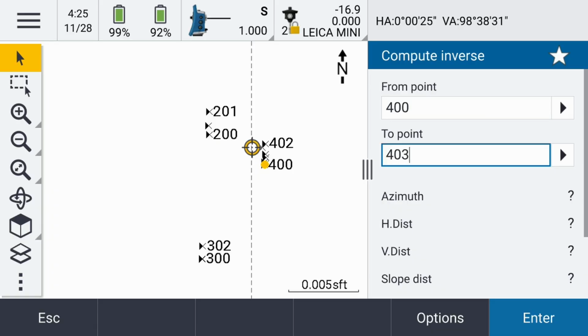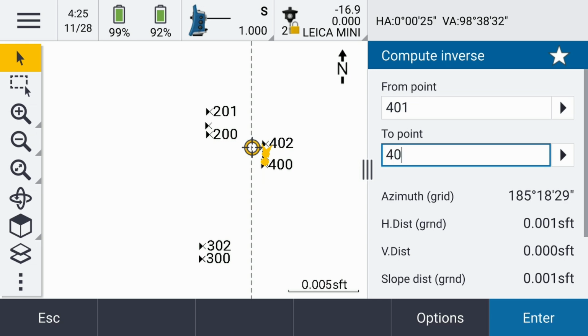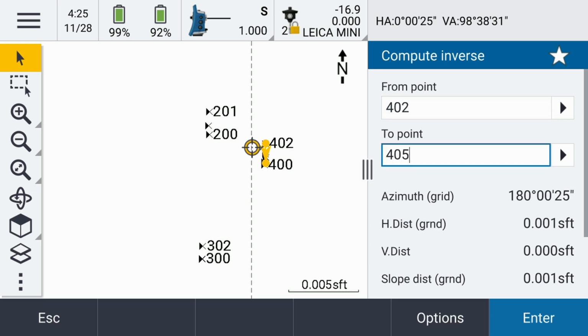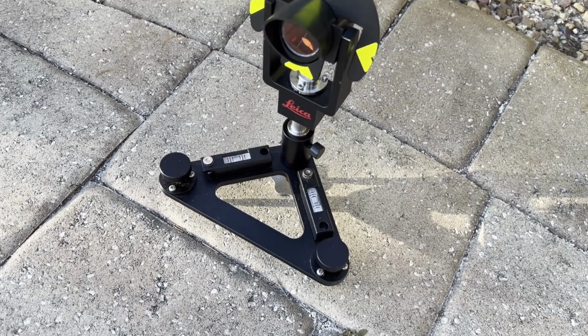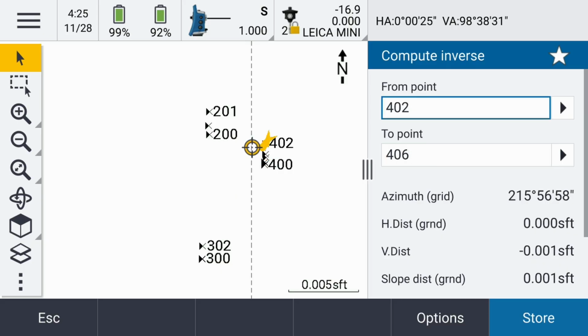And finally, the G-Rock mini Tribrach. There was no clear difference between when the Tribrach was tilting towards the instrument or away. All measurements were within 1,000ths of a foot of each other, just the random error of the distance measurement itself. This is because of the highly sensitive level bubble and the short height of target. I also flipped the entire Tribrach 180 degrees just to see if that would introduce any error, as these spirit level bubbles are more difficult to check and calibrate in the field, and still there was no change. All measurements were 1,000th of a foot or less, a fraction of a millimeter.